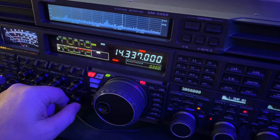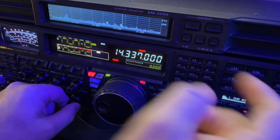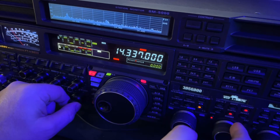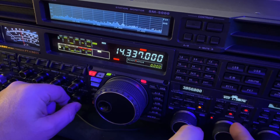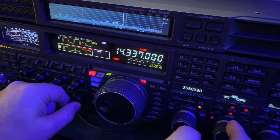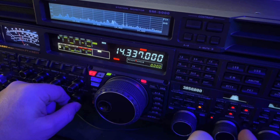Ryan's an S9. I guess the interference isn't coming back. I wanted to show you how I dealt with it, which was shift. I went to a width of 1.5. That's what pinches up Ryan's voice. Maybe 1.65 would be enough. And then I shifted negative, because the interference was the higher-pitched interference. If it's high pitch, you go negative. If it's low, you go positive.